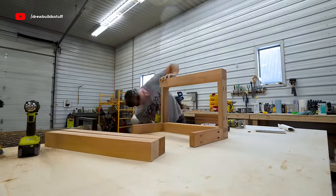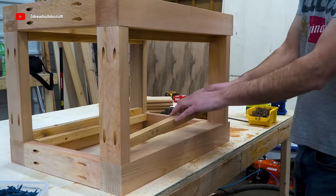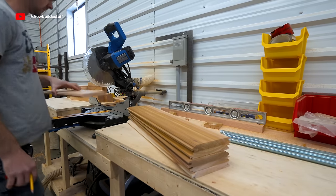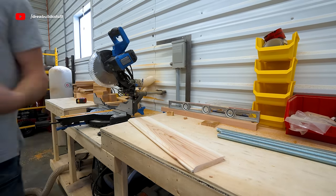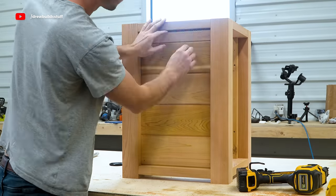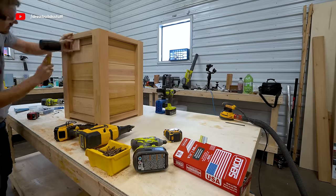One last thing to build for the patio set — a little end table that also doubles as a cover for the propane. I used some four-by-fours and two-by-fours to make the main frame, then screwed some offcut cedar pieces into the four-by-fours as backer boards for paneling. I have a bunch of clear cedar tongue-and-groove offcut pieces from my sauna build and I'm cutting these to the right length, then using my 15-gauge nailer to run them along those backer boards to close in the end table.